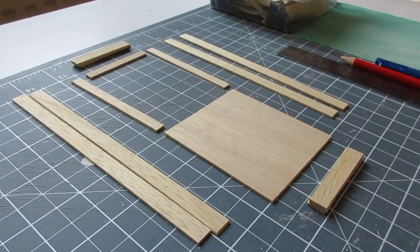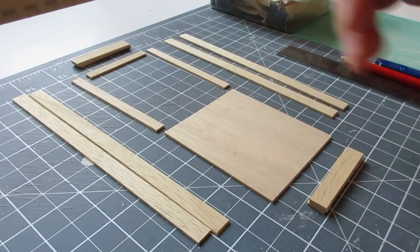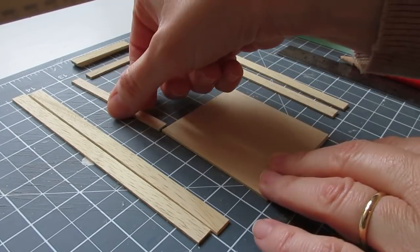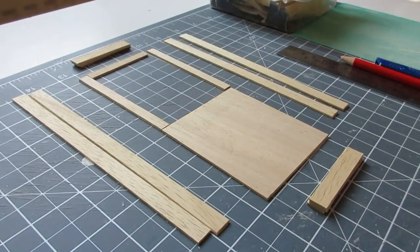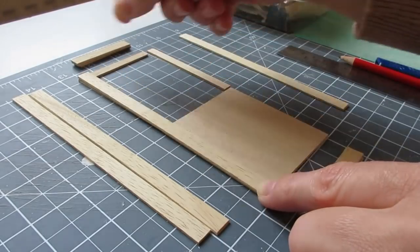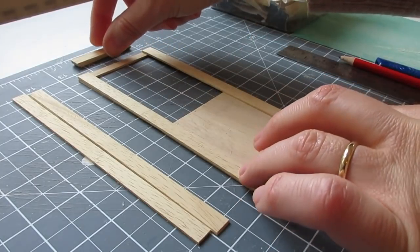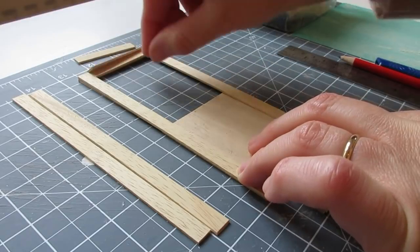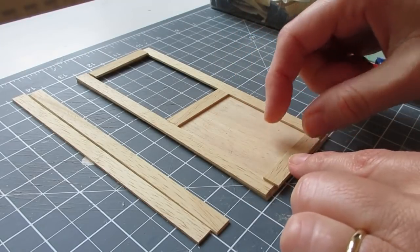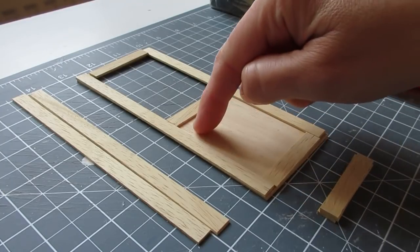For the kitchen door I'm creating a glazed door, where the top part will be glazed. I build it up like a sandwich with three layers — a central layer with moldings on either side. I've got strips that go down each side of the door, horizontal strips across the top and in the center and bottom, and I'll create a couple of panels in the lower section. The handle will sit in the central area.